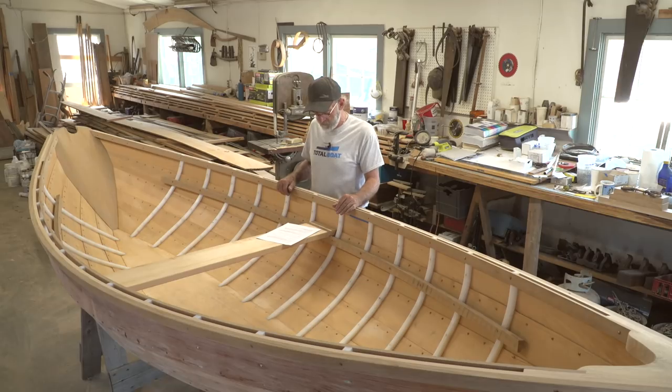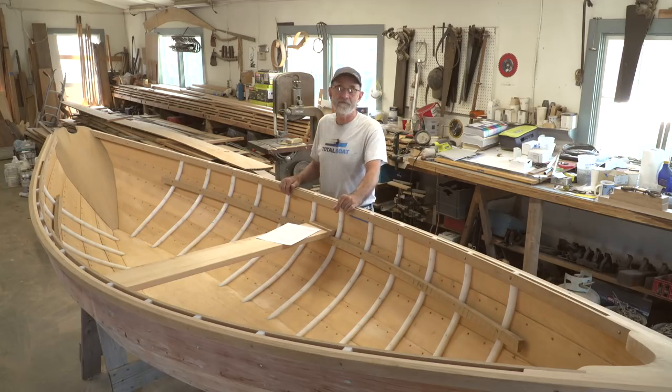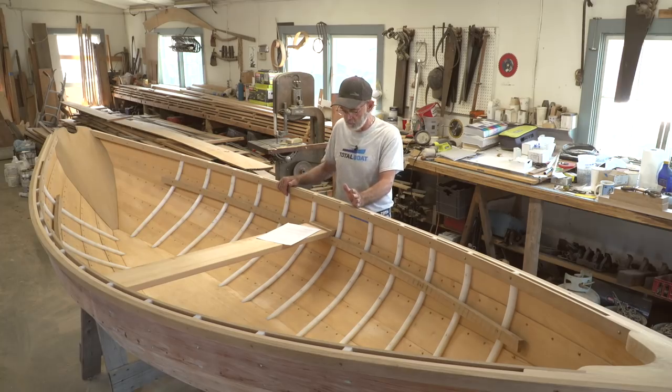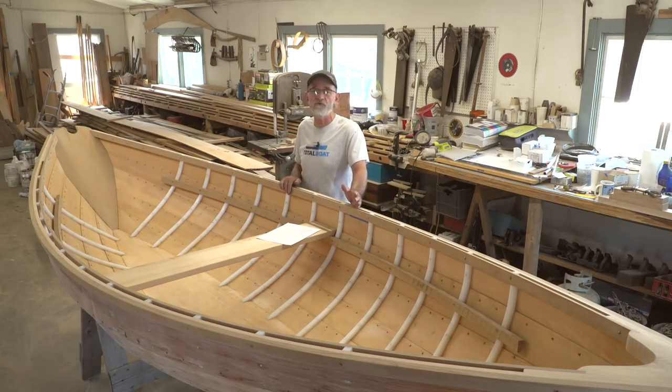Wes Soldiers asks: 'What would be the first wooden boat to build?' It wouldn't be a dory — that I can say for sure. They're complex to build and there's quite a bit of understanding that has to go along with it. My recommendation is always to build a little skiff, like a rowing skiff with a rockered bottom that you could put a very small outboard on. Not looking to plane it off, but it would row quite easily — a cross-plank bottom and maybe one lap in the sides or just smooth sides, like a flat-iron skiff. There are numbers of different designs that would be the best first boats to build.